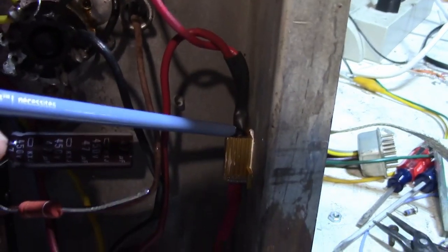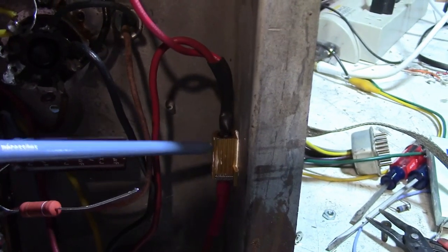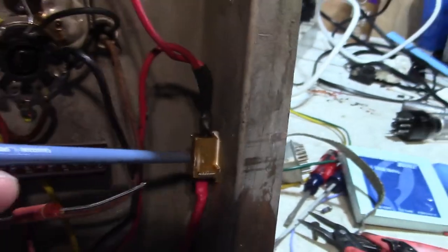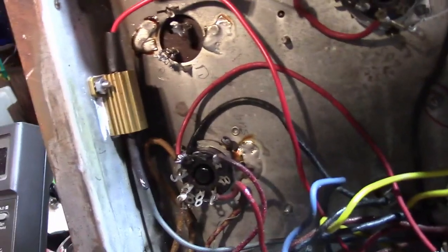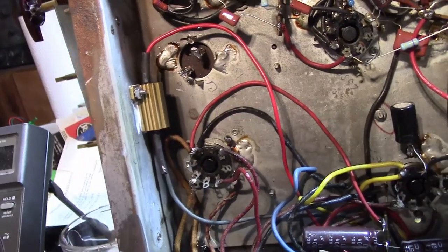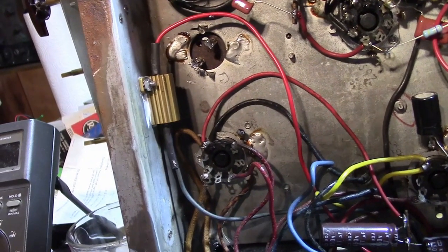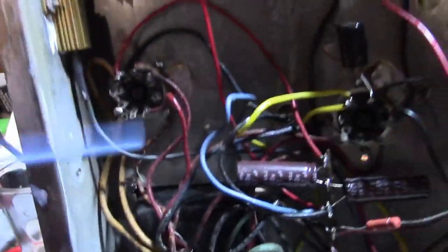It depends on the model — the larger ones have more of a breakdown voltage than the lower ones. It seems like it's somewhere in the order of a kilovolt, as near as I could make out. So I think we're okay. I Googled things like: what is the voltage breakdown on an aluminum housed chassis mount resistor between a lug and the chassis? The spec sheet only gave it in AC, and it was on the order of one kilovolt or more AC. So I think we're okay because we're well below that.